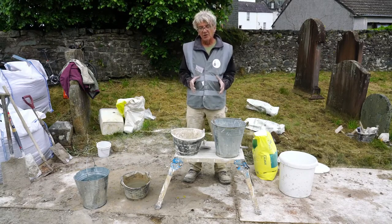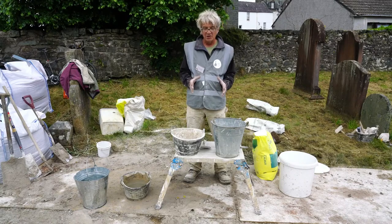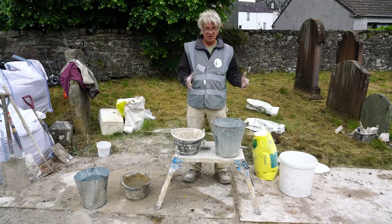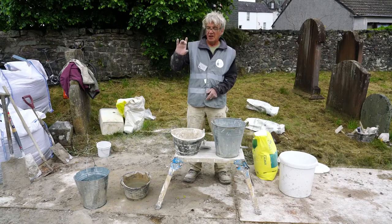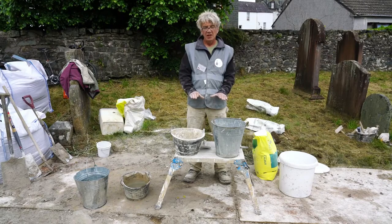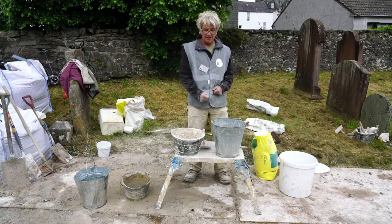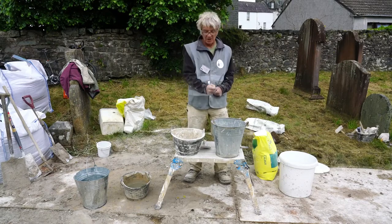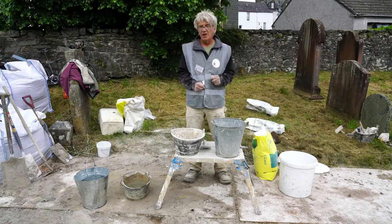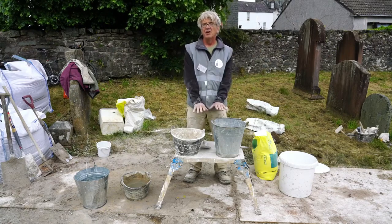In the case of shelter coats, when we made those from lime wash, from lime putty, which we did, a bucket of shelter coat would arrive, and at the bottom of it there'd be a layer of concrete, because the aggregates were really well graded. They'd sink to the bottom before it arrived. You'd actually often have to get a chisel to break that up. You'd mix it into the lime material, the lime liquid, and if you were lucky, you'd get it to where you were going to apply it before all of that had sunk back down to the bottom again.